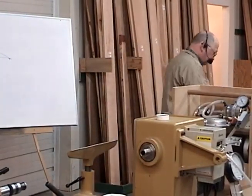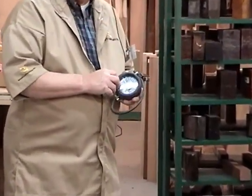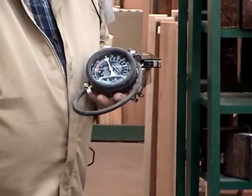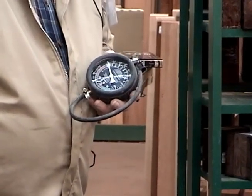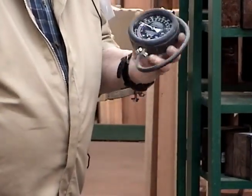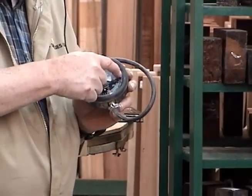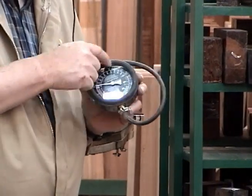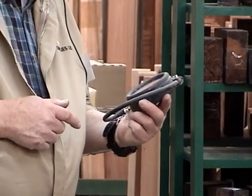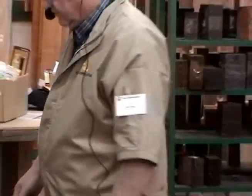When we're talking about vacuum we talk about inches of mercury, pressure, PSI. It makes it easier because you don't have to say 'I'm pulling minus 10 PSI' — you say 'I've got 20 inches of mercury.' I'm going to pass this gauge around. It's set at zero. If you put pressure in it goes clockwise; if you put vacuum in it goes counterclockwise. The scales are labeled in inches of mercury and pounds per square inch, and it's got some metric too. That helps illustrate the difference between pressure and vacuum.